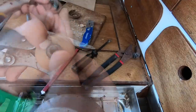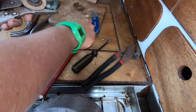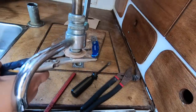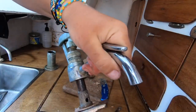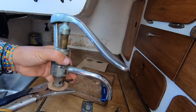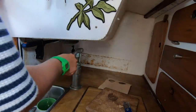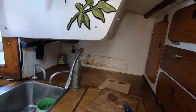This guy goes back on. This guy goes back on. The little ball goes back in. The pump screws back on. It was tight last time, but not crazy tight. Ball still jiggles around — that's a good sign. New gasket. It's a little bit stiffer than it was before, but hopefully it's going to prime better. So there you have it — DIY leather gasket valve for hand pump.